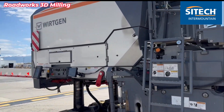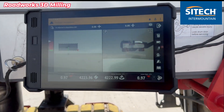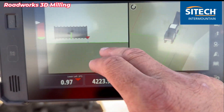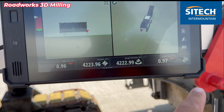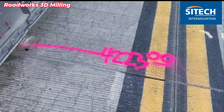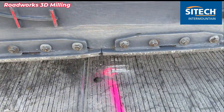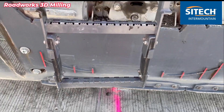We ran the TD540 screen off to the side right here, and here's our model — the model of our apron that we can mill. Cross-section view. We've already benched the machine in, that's why you see this done right here. What we did is came to the elevation on the ground right here. We've already set down and touched in and benched in the middle — came down and nipped into the concrete and benched.